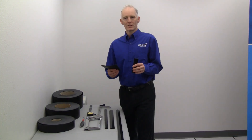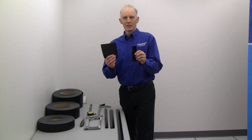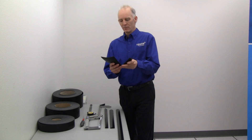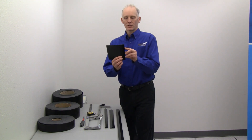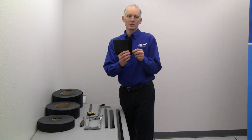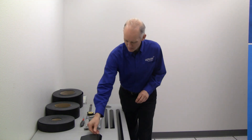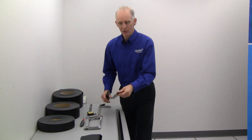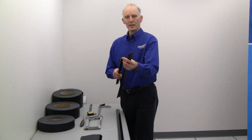The components of a rack airflow management kit are a plastic extrusion and a flexible membrane. The flexible membrane inserts into the extrusion, and then the extrusion attaches to the rails in the cabinet to seal an opening. The extrusions are available in either a 45-degree angle or a 90-degree angle.